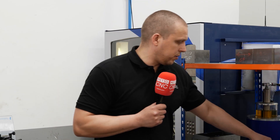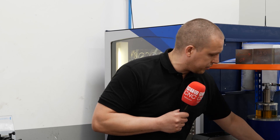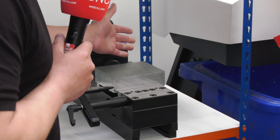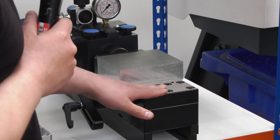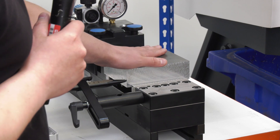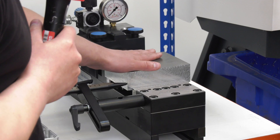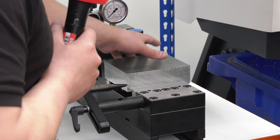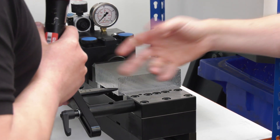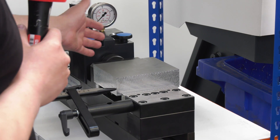In fact, show us. So you take the piece of material, you set it up in the pre-stamping unit, because this mimics your vise. So wherever you place your part in, you're able to put it into the vise the same way. Your loading scenario is already sorted, so you know it will be in the right place. You put it against the stop, set your pressures correctly. You just adjust this manual stop to wherever you want it on the machine.